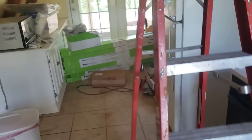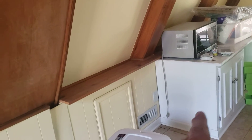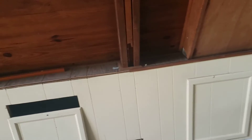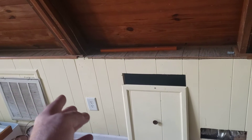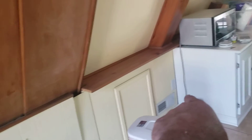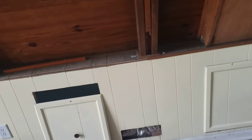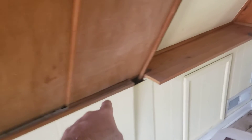On this wall — the outer A-frame wall of the house — on the right side there's a low vent and some white cabinets. The access holes will all be covered. There's a low receptacle that will carry to the left-hand side. There are 128 inches between the edge of that receptacle and the side of the vent, so we're going with 123 inches of cabinets, about two and a half inches off both ends for a nice fit.